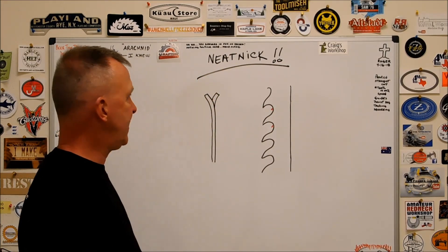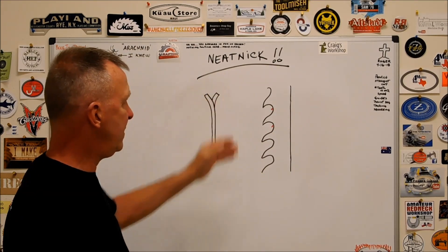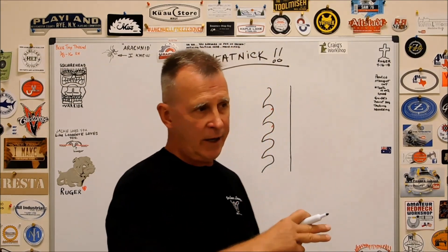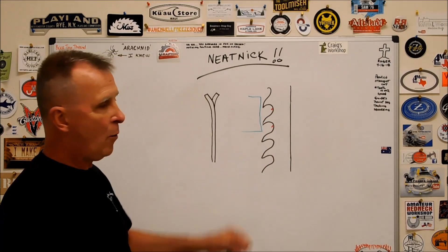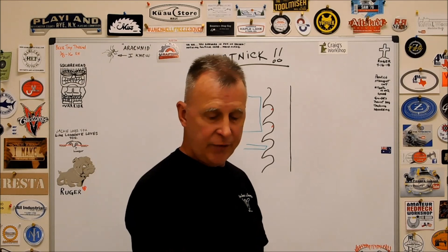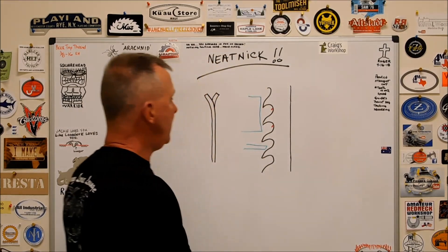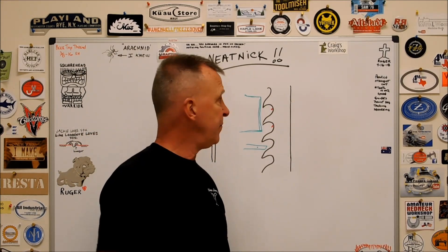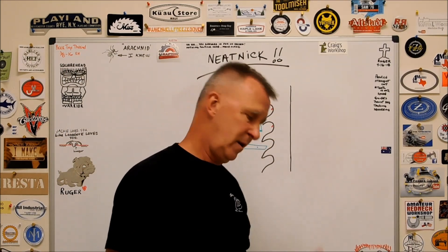This is what the blade would look like looking at it from the top — if you were coming around the rollers and looking down, each tooth, every other tooth, every third tooth, whatever, is going to be set. The blade that you select should engage at least two teeth into the material at all times. You do not want to cut material on a bandsaw that fits in between the teeth — it is going to strip those teeth off and shoot them everywhere. Make sure that you have two teeth engaged. A coarse tooth for thick or soft material is fine, but if you've got a skinny material, you're going to need a blade with a lot of teeth. Keep that in mind — it's a good rule of thumb.